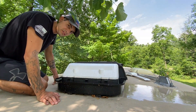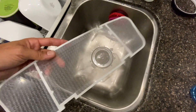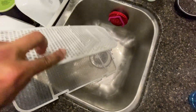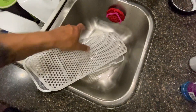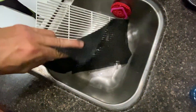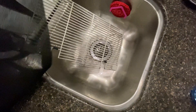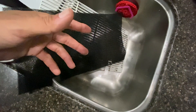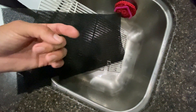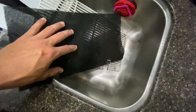Let's go down inside and we're going to clean the filters. I just took my AC filter and cover off and literally just rinsed it here in the sink with fresh water, got it nice and clean. Same thing with the one from the living room — this was just horribly caked, brown with dust all over it, and now they're nice and clean. Really easy to do, just right here in your kitchen sink. Once that's done, you can pop it back up and the air coming across the air conditioner will dry them out real fast.